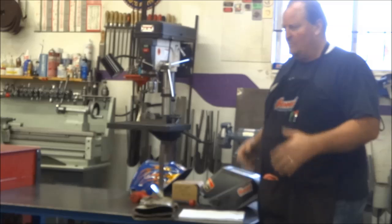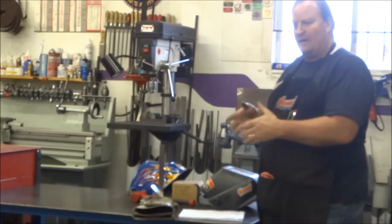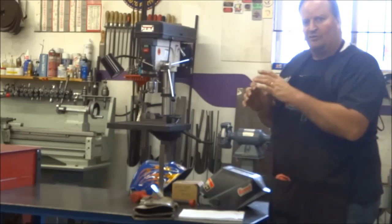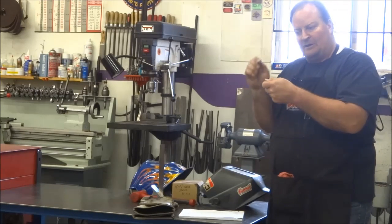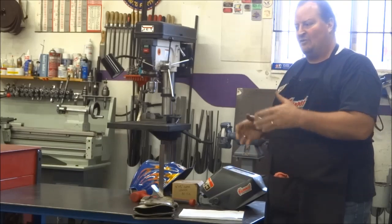Basically, what people are trying to accomplish is that overlaying of the beads to make much like the looks of a TIG. A TIG welder, you get that by creating a puddle. When you dip the rod, it cools the puddle, it freezes it in a sense, then you move the arc ahead, you create another puddle, you dip the rod, all while maintaining a continuous arc.